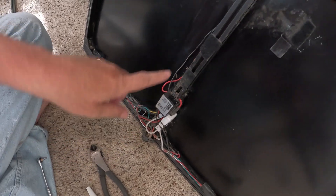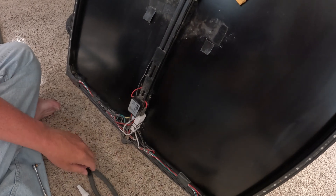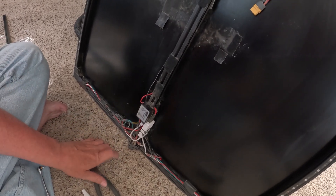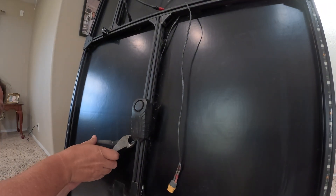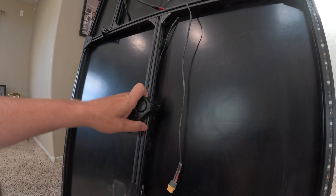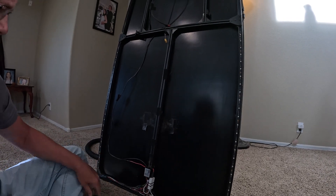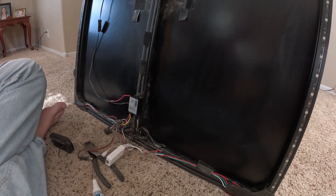I need to move some of my wiring so I'm able to shift this rod over and put in the new one. I'll also have to check my wire lengths. I'm going to have to remove the bike alarm since some of the wiring goes under the clips holding it on — just zip ties. I'll get the main wire loose there and then try to loosen all this up.